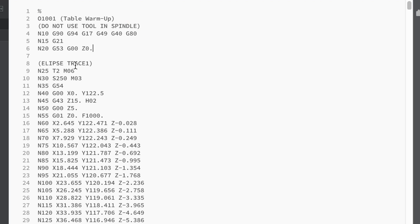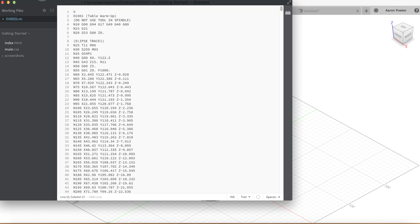Okay, so what we're going to do here, where it calls up the G54 in my controller, I'm going to make this G54 P1 as my work offset. I'm going to take tool 2 out and use my empty pocket, which is tool 11. This is the one I use my probe in. I won't do this spindle warm up with the probe in it. So I need to alter the height here as well and call that height 11. We can save that now.